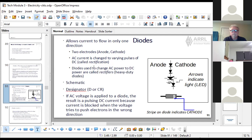I don't know, this is probably way beyond your memory and time span, but people used to make crystal radios. The crystal radio had an anode and a cathode. You'd connect one end to an antenna, and connect a headset in series. What it would do is draw the radio frequency from a radio station, turn it into pulsating direct current, which made the little plates of the headphones vibrate, and you could listen to stations.